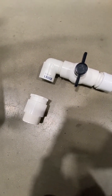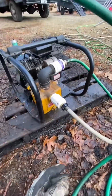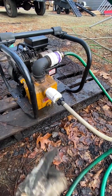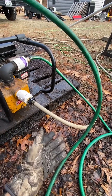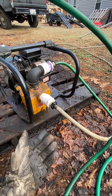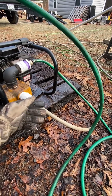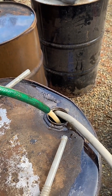And then into the two inch thread that's on the 55 gallon barrel. Let me show you what I'm working with right now. We have the gas pump — it works. We have the couple fittings discussed at the store mounted up here, intake and discharge. The only problem I've had so far was priming — this hose is 25 feet. I just had to fill the pump once and then it started sucking. I think the solution is to put a valve on this side too, so when I store this hose I can leave oil in it to stay already primed.